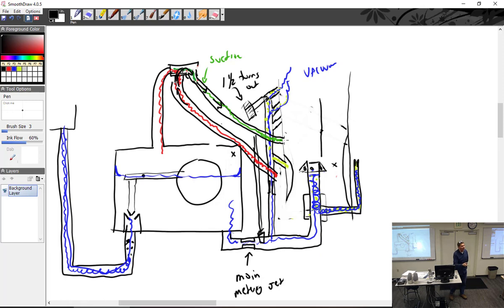We screw it all the way in gently and back it out one and a half turns and see how it works. Well, what does see how it works mean? Start it up. Does it feel okay? Feels okay. Add some throttle. Did it take the throttle okay? Took the throttle okay. Pull it back. Pull back okay? Yeah. Well, then that's good. You're done. Go fly it.